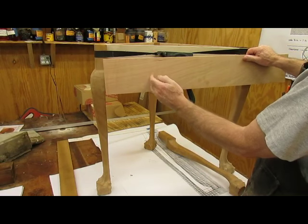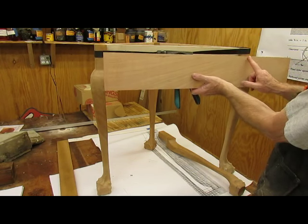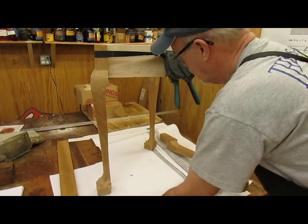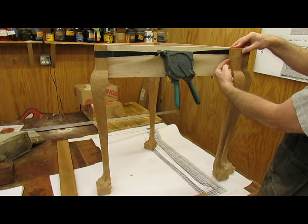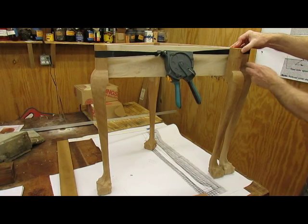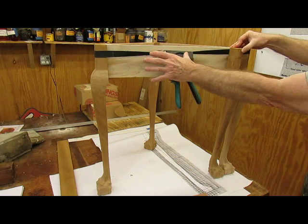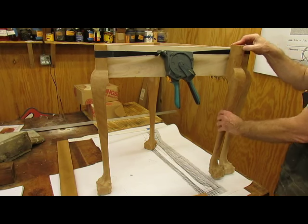The other half of this cherry piece will be the swing leg. We'll put a hinge here, then a tenon onto the end of the swing-out piece, and mortise this leg into the hinged piece so that it will close into position. The spacer piece holding the back piece will complete the entire side. There'll be a mortise here that goes into the swing — we've got to build the hinge. So that's what we'll be working on next.